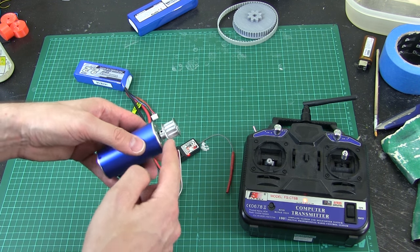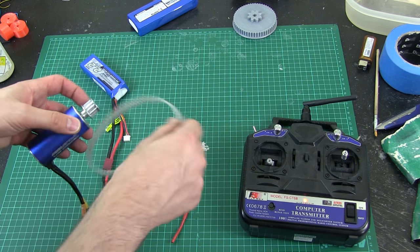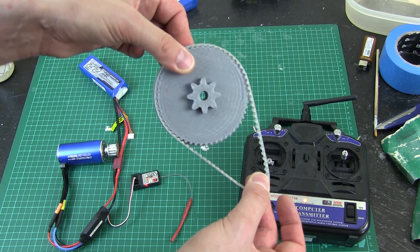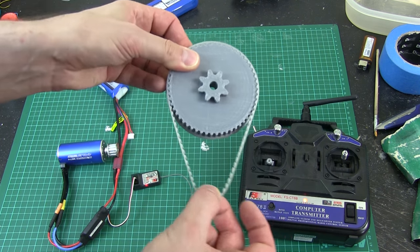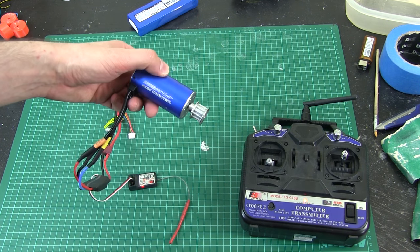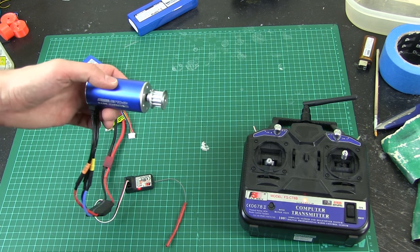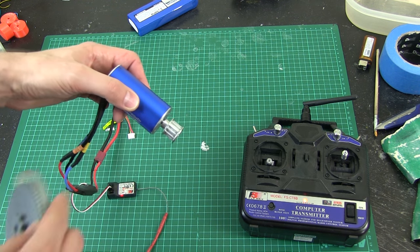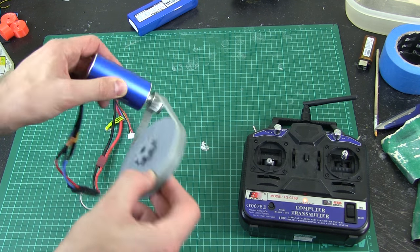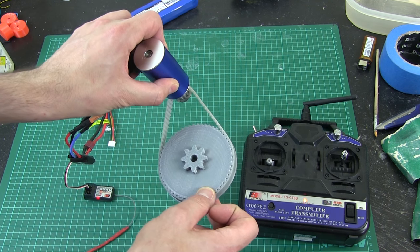What we really need is to make some sort of gear train so we can realistically see what we can get out of this and try to test the torque. I've got a belt pulley on here which is a T5, and I've previously experimented with making a T5 pulley with a gear on it. We're going to use belt drive for the first stage — so we don't end up mashing a 3D-printed gear at 20,000 RPM — and then take it through progressively larger and smaller gears until we get to a reasonable speed.